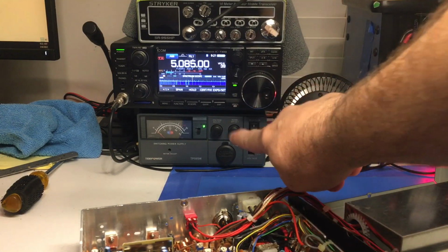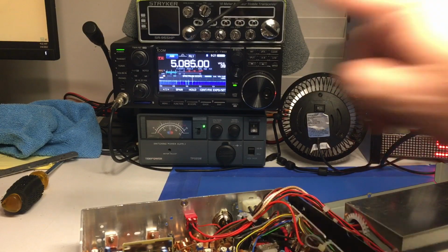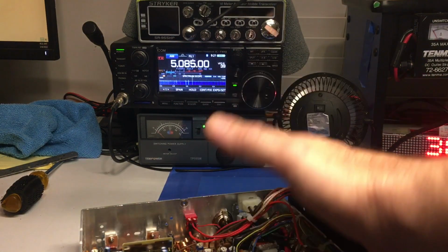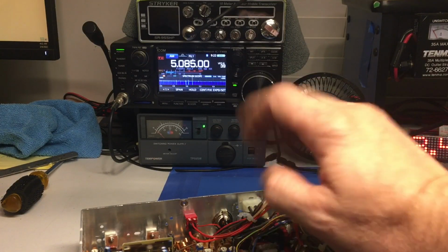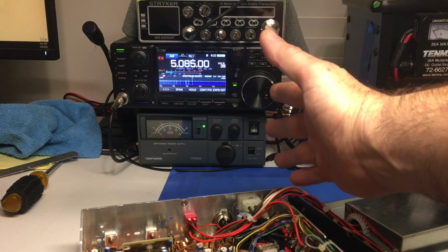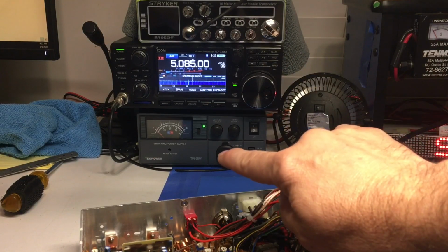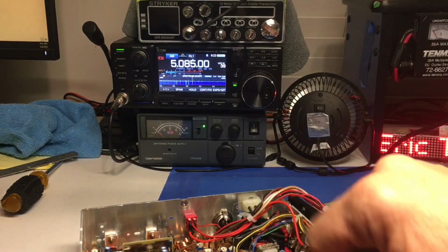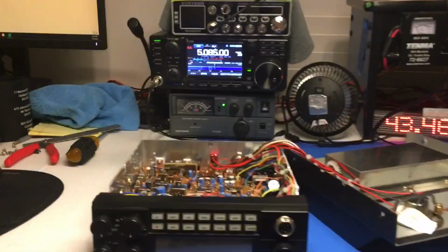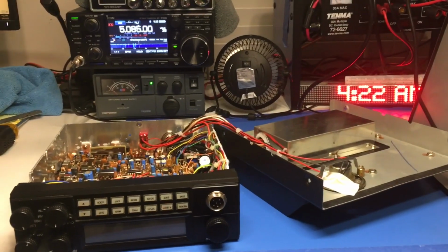Make sure you get a good power supply, something decent. I always like the old school Astron power supplies. One of my first ones was an RS12A, and it works real nice, but of course it's 12 amp surge, so it's very minimal. But a 50 amp power supply is at least the bare minimum of what I would use for anything. You always want to have some extra buffer, extra room, to run a couple of radios off of one power supply. That's a great feature, especially with the 2970. If you have one of these, you definitely have to have a good power supply with it.